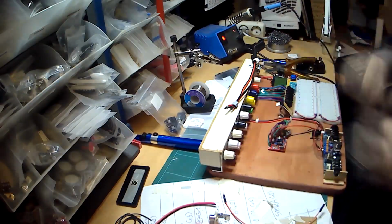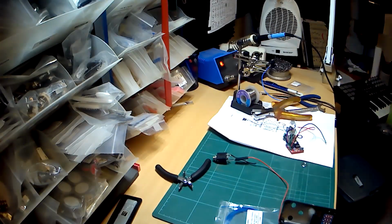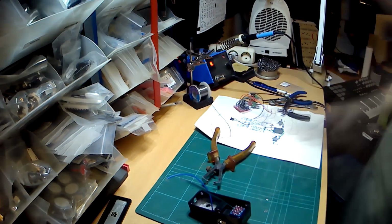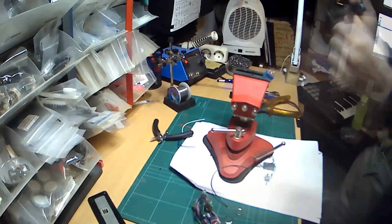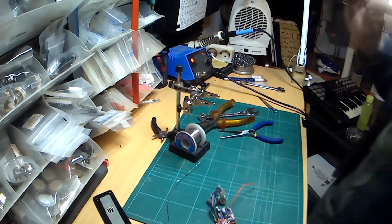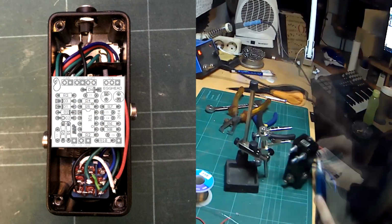This was one of my earlier builds, so I wasn't familiar enough with component sizes and stuff like that. The capacitor I had stuck out too much vertically, and I had already cut off the leads at the bottom, so I didn't have the option to bend those leads and the capacitor out of the way. I did have some room left in between the daughter board and the in and output jack where I could angle the board down a little. In the natural orientation, this didn't help enough and I still couldn't put the lid on.